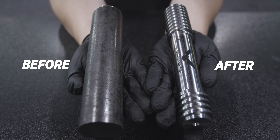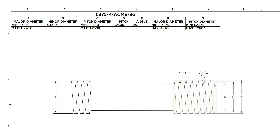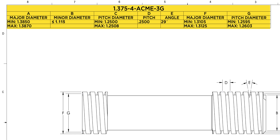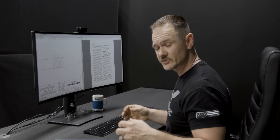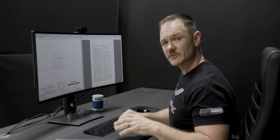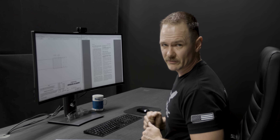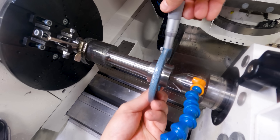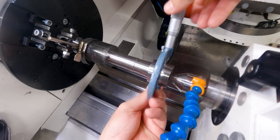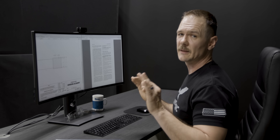The thread that Chris is going to be making for us today is a 1-3/8-4 TPI Class 3G Acme thread. Based upon that, there are several tolerances that he has to hit. The first diameter he's going to be installing is the major diameter on our no-go side. In order to get that dimension and all the tolerances, along with the other tolerances for the other features, we're going to use a combination of thread specs for that specific thread along with tolerancing information that we find in ASME B1.5. His no-go major diameter needs to be 1.3105 to 1.3125. This diameter is really just a clearance diameter to make sure that when he's using the no-go side, he's only going to be checking the pitch diameter.